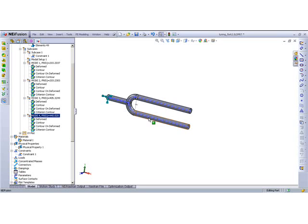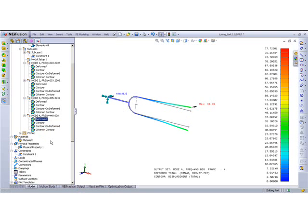If we were limited in this case to this particular stock size of material, this is how we have to cut it in order to obtain this natural frequency. So there's our clamping mode — the ringing mode of 440 hertz. Thank you so much.